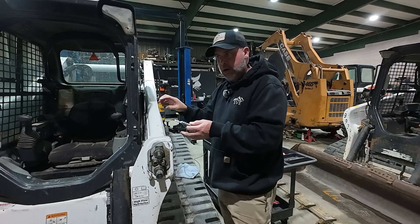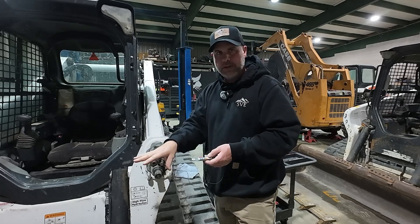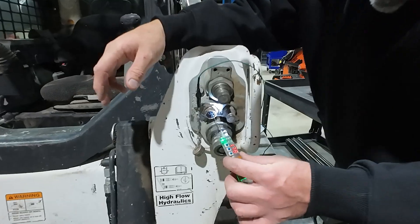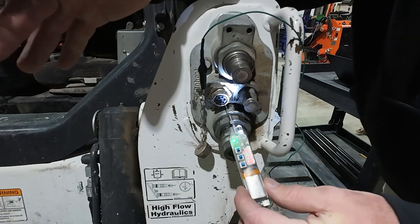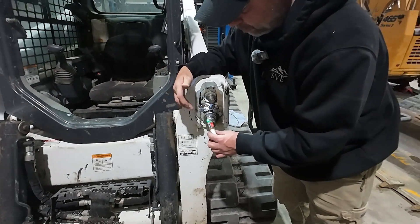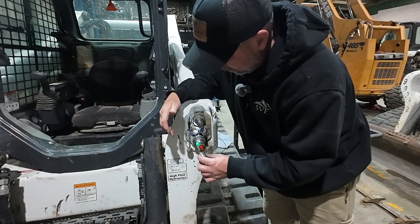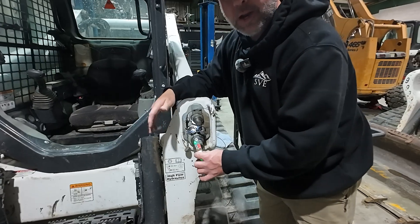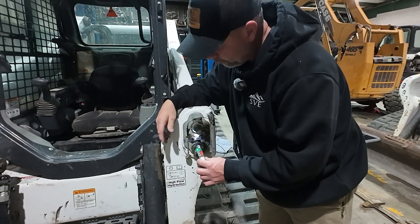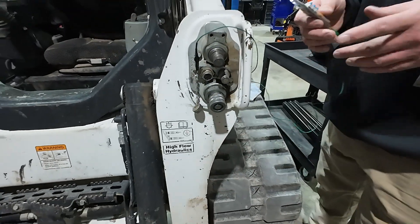That's the problem with the machine — I already found it. It was a quick, easy fix and now we've got the RACD powered up and working. On our smaller pins — the CAN bus lines — we check voltage. The two CAN bus voltages should equal five volts, so I'm looking for two pins around two and a half volts each. I can confirm I've got power on both CAN wires.